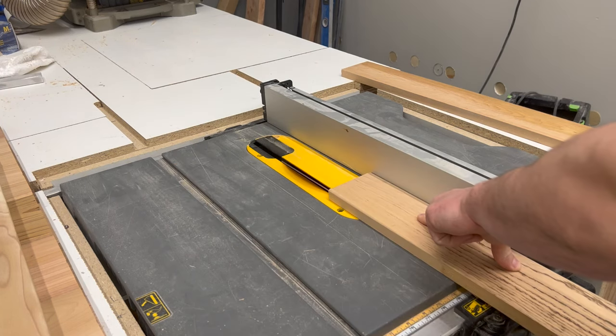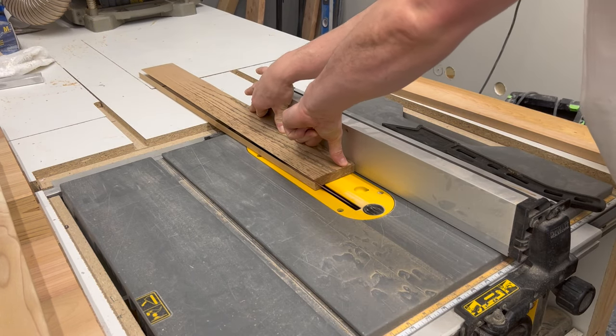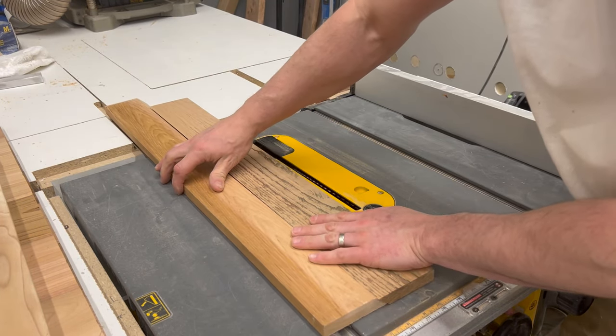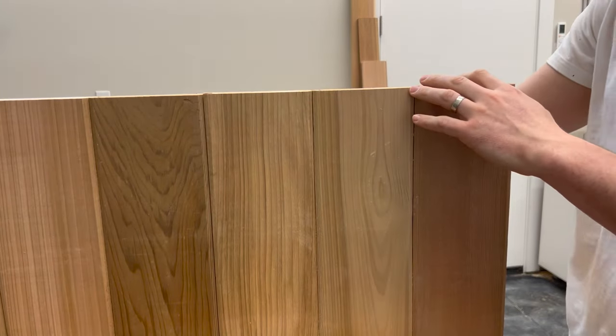Since I was putting the rack over all the electrical components, I would need to make it so this rack could be removed to access those components. I did this by adding a mounting plate on the wall with a 45 degree miter on one side. And the rack itself would have the inverse 45 degree cut.